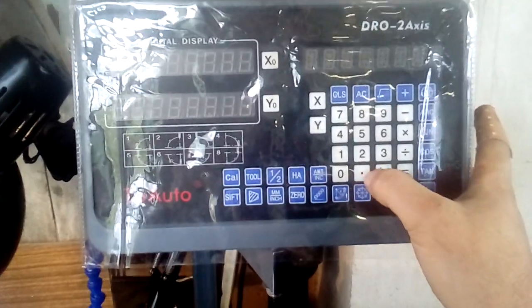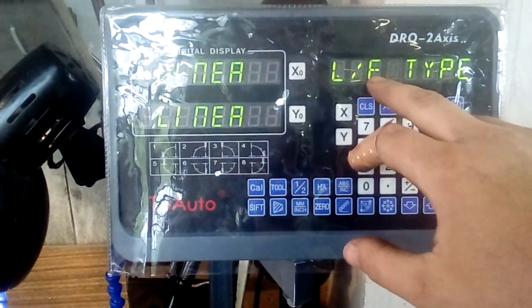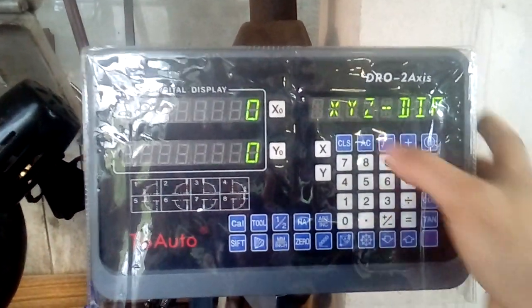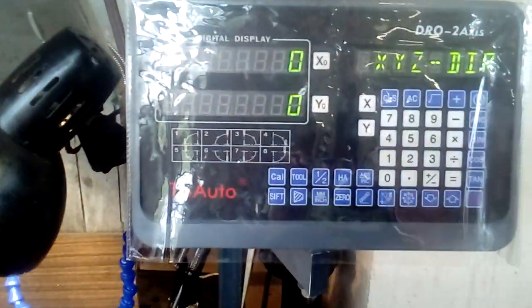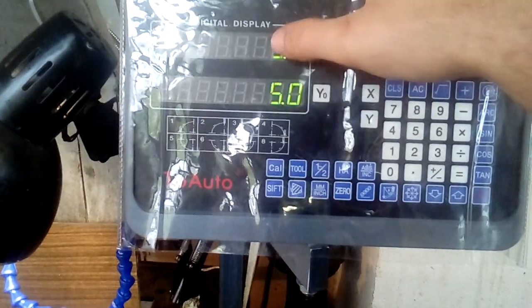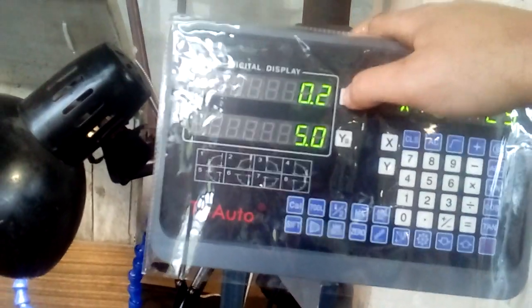The first menu: when you start up, push the point button and you come to L and E type — I don't know what that is. That's after inch if you work in inch. XYZ compensation — I don't know what XYZ direction is; I think it's plus or minus depending on the way you set up the linear scale. XYZ resolution is very important — you need to set the resolution for what is written on your axis. If your axis has one micron resolution, put it at one micron; mine are five micron.